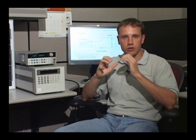The measurements are in the form of voltage and current digitizers, so you can control how fast you want to go through the curve. For instance, if you're doing flash testing you can easily cover a panel that's 250 watts with a 50-volt open-circuit voltage in 10 milliseconds, or if you want higher accuracy you can take longer digitized measurements to give you more averaged measurements.